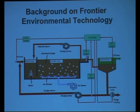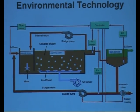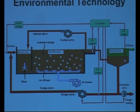So this is basically a sketch of a conventional activated sludge system where you've got a pre-anoxic zone, aerobic zone, final clarifier for liquid-solid separation, and a return sludge pump with some recycle. Generally this is so complicated you've got a number of problems, and you have to hire a full-time operator to run this thing to get it to work right.